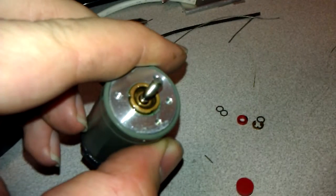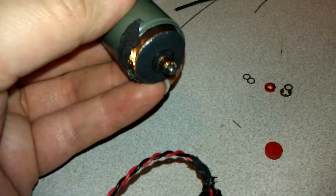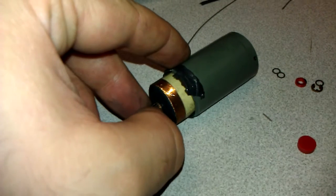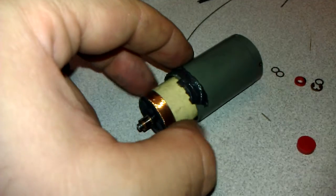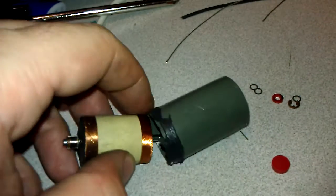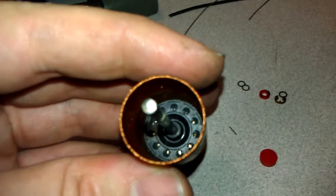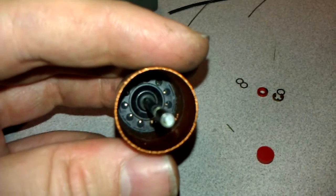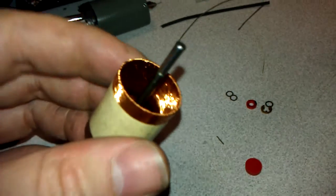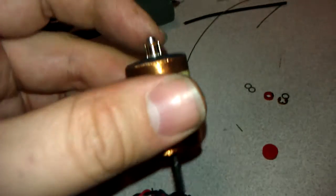It was clipped up here at the top so it didn't just fall out. When we extract it, there's a surprise. You may be used to seeing iron cores in your motors — not here. Steel shafts on the magnet. It is completely and totally coreless. What this means is when you rapidly shift the boat from forward to reverse, you're wasting a lot less energy.